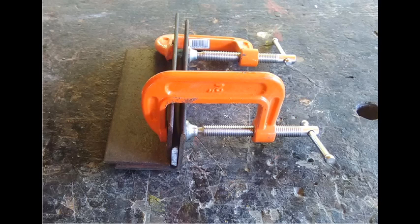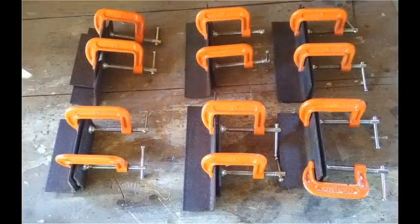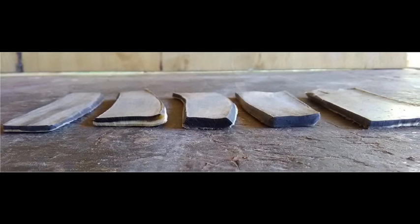You'll need quite a few of these clamps — you can get them for three or four bucks apiece on special. They're just two-inch C-clamps but much stronger than the clip-on type used previously. Here are our six pieces of horn sitting in the clamps, ready to cool down. Leave them to cool for 24 hours, or overnight if you're doing this during the daytime. It's very important to let them cool fully, otherwise they won't harden properly. And this is the fruit of our labor — nice flat pieces of horn, ready to be used as knife scales.